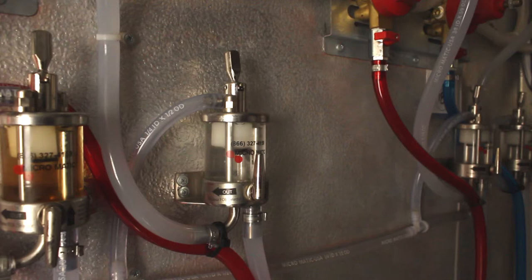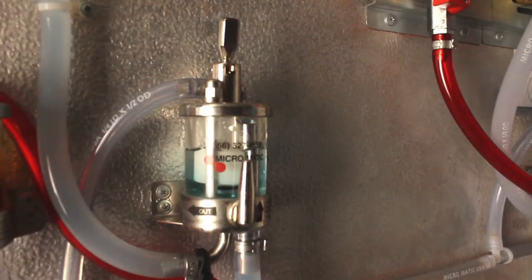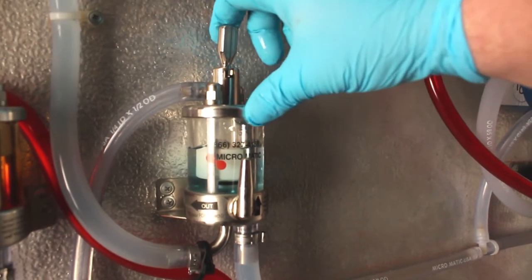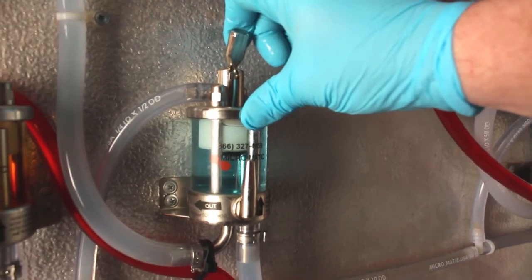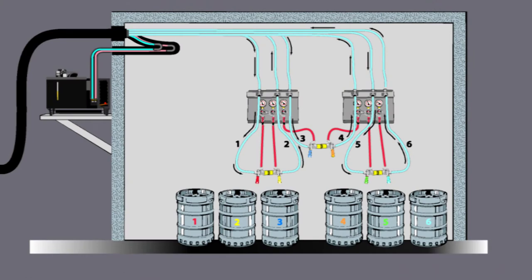So if you're in a store that has a long run and you have FOBs present, these are a huge money saver, but we have to make sure in the cleaning process that we bypass these. The other thing we have to make sure of — when chemical starts to pass through the system, we have to come in here and bleed these full of chemicals, because these drains get really gunked up. So we actually have to put chemical through the drain in order to keep this from getting plugged up or clogged up. That's really the process in here.